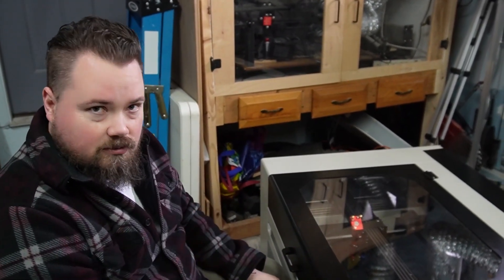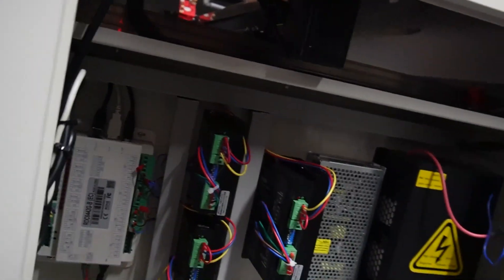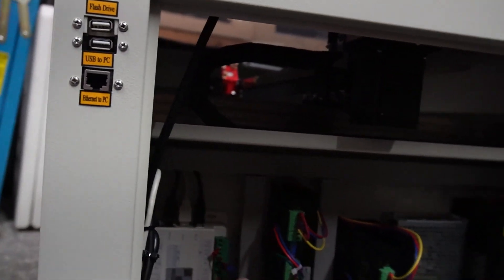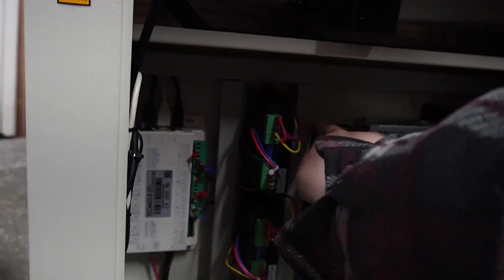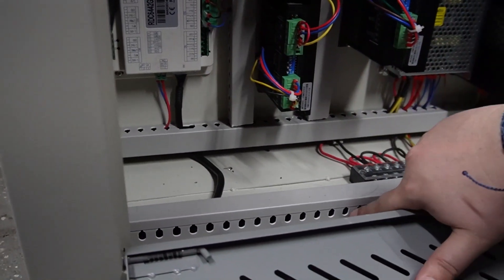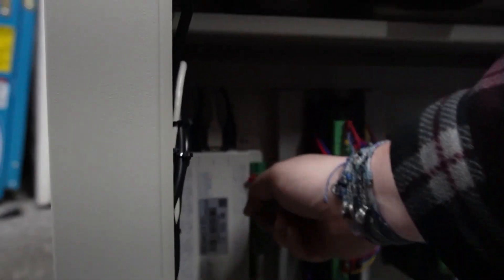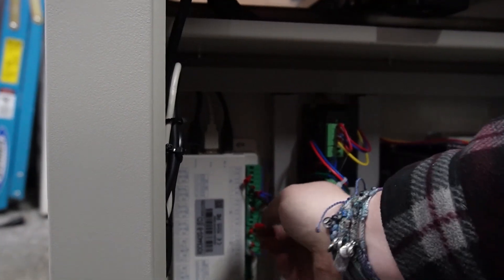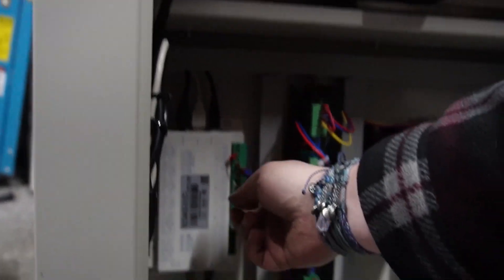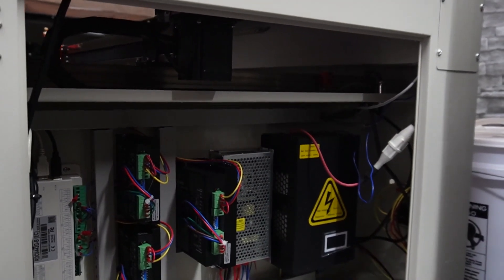Now I did have to plug it in to test, so stay away from the power wire. Unplug from the wall again before messing with it. Got both cable covers back in — they went in way easier than they came out. On this side, take your time — it has slots that are kind of hard to see, but you can push the wires down in there so they have a place to come out without getting pinched. Take your time with these delicate wires and get them where there's not a lot of tension.